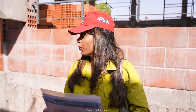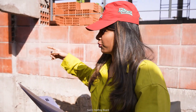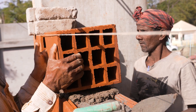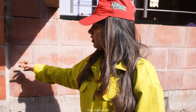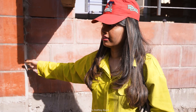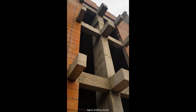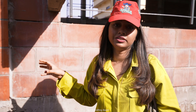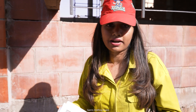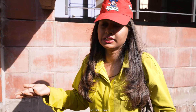We are here at the construction yard. What I am going to show you is the stack bond of the bricks — notice the detail. In order to make the facade look seamless, we have a 50mm collar. This was done so that wherever the columns and beams are coming up, they get enveloped by these bricks. Because we use such huge porotherm bricks, we could do that — the bricks are not brittle, they are huge in size, so the chopping could be easily done.